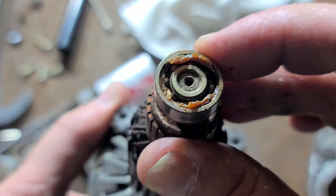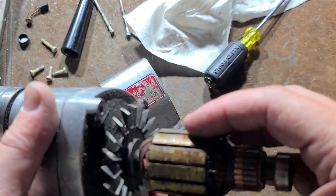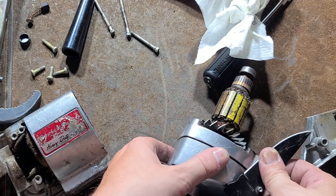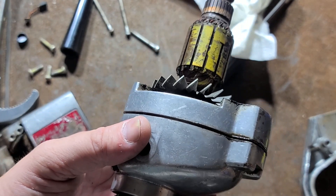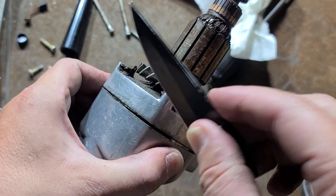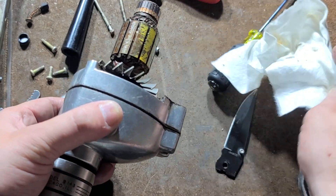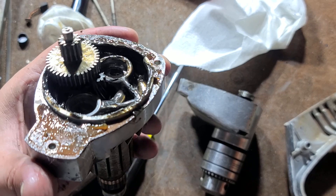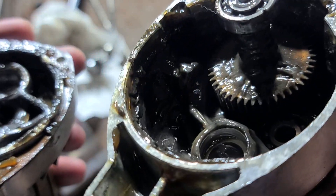Definitely a ball bearing on the back of the motor. This ball bearing doesn't feel super great — the grease is really hard, so I'll keep this bearing and put a little bit of fresh grease on there. Pulling it out, the bearing came out of the front a little bit too. To get the gear case to split without doing damage, I actually just have an old knife blade — I'll get that right in the little crevice and then just tap it. That basically uses the knife blade as a wedge with a sharp enough edge to squeeze into that little gap and start these things separating without trying to drive a screwdriver in there and really dinging it up.